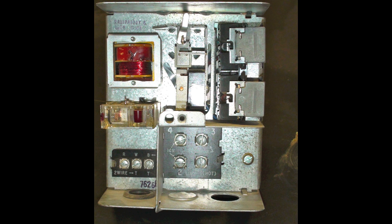If you look in the lower right, you've got terminals 1, 2, 3, and 4. One is your hot lead — that's the one you're going to switch. Two is going to be common, which you'll hook all your commons up together. And three is going to be the burner motor itself. Four will be the transformer for ignition.